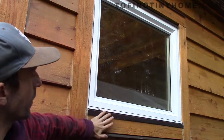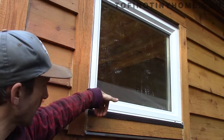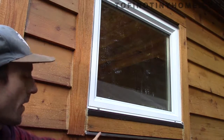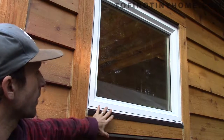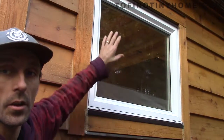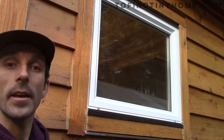Below the window, we have a piece of flashing that hooks back over the rain screen, and this is sealed under here. Then a 2x4 for the trim and then another piece of flashing. So these windows are really well protected from the water — that's two pieces of flashing on the top and two on the bottom. It's overkill. A lot of people don't do so much flashing, but that is how I did it.